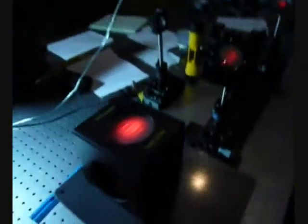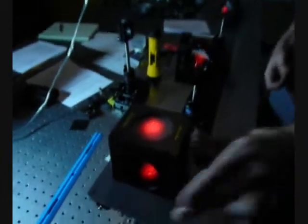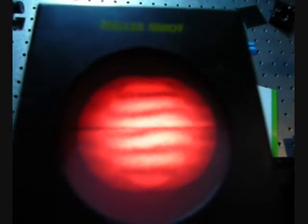For this part, we're using a reference lens after our shear plate where we are coming back through a mirror on this side. We have the focus of the lens at the front focus of our mirror, so that we have collimated light coming back through our shear plate. What we can do is add defocus to our mirror, and what this does is change the fringe angle on the screen. Now if I move back to our null, I can add tilt to it as well.